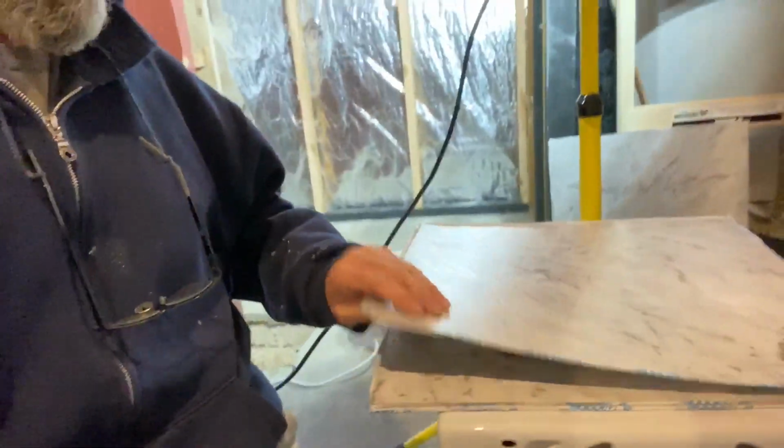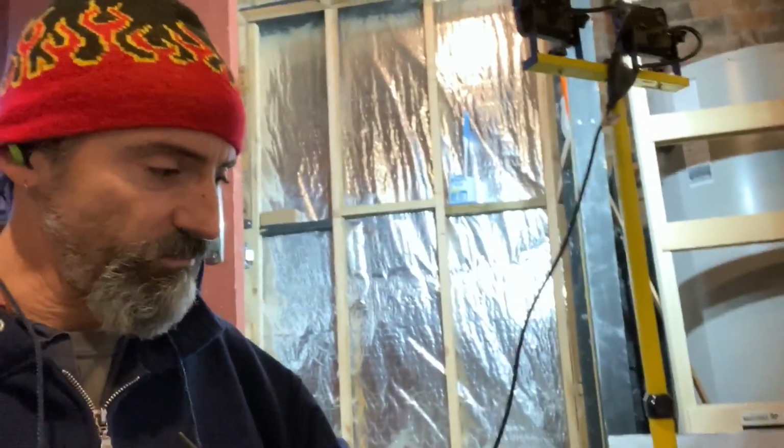Now I've just got to wait for that to dry to put these tiles down, because you see these, if you've never seen them, they've got an adhesive backing on them. You just peel off, stick down. So yeah, I thought I'd be getting the tiles stuck down today, until I had a thought in the back of my head that there's probably a little bit more prep that needs to be done. So I went to one of the smaller boxes where I've got a full box and it said instructions inside. And yeah, it says just to make sure that you've got the surface sealed, because you want them to stick down. You don't want to put them down and then have them peel up because the floor's too dusty or loose.